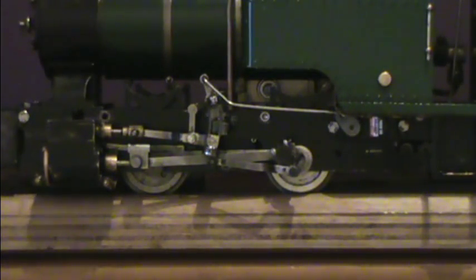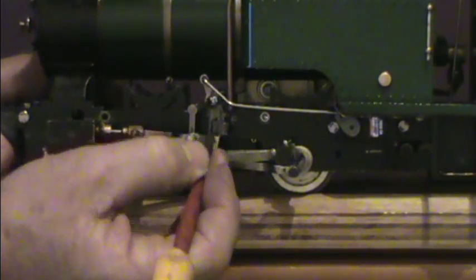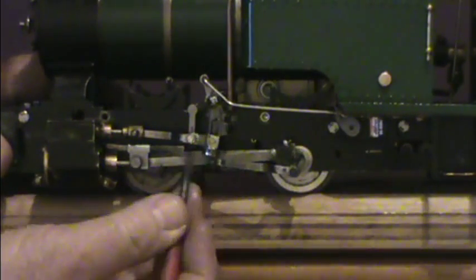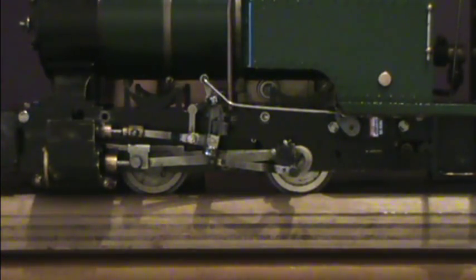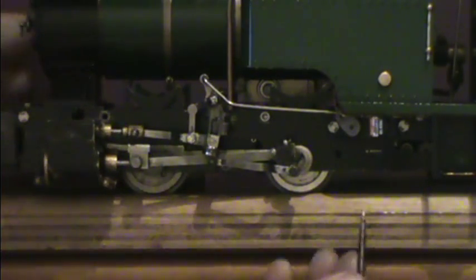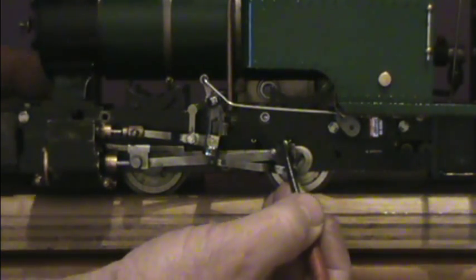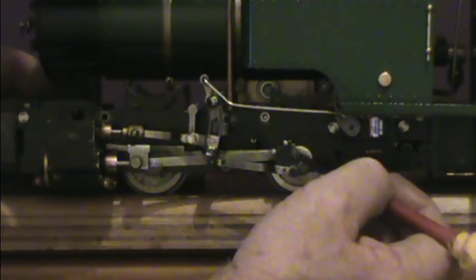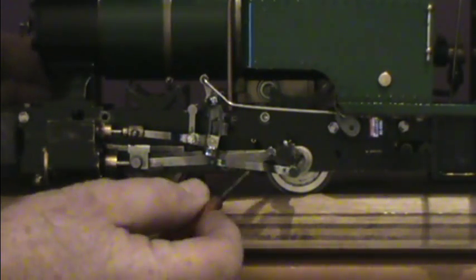With about an hour on each side, I usually get them within 0.05 of a millimetre. In forward, moving the engine forward through the process, if the second distance you measure is greater than the first, it means the return crank has to be turned slightly to the front, which I do just by tapping. Then, when I'm happy, I do up the bolt.